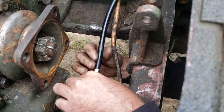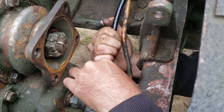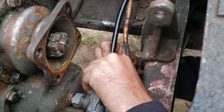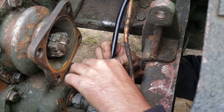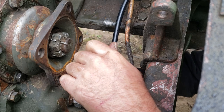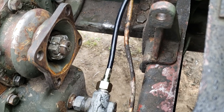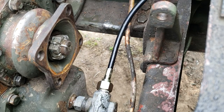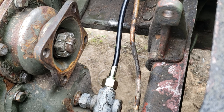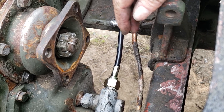Now getting the cable in there is another fun thing, but it's just that one keyed drive, so it's not like you gotta line up a cattywampus hex or something to get in there. It only goes in one way. So that's it, guys. The rest of it is just running it up to your one cable clamp you got on the floor and then up to the transmission tunnel to the speedo. So nothing to it. That's all I wanted to show you, some little specifics about that.